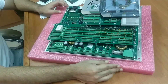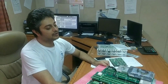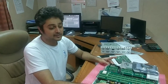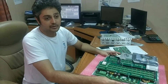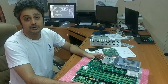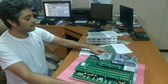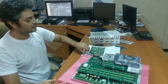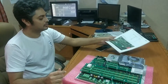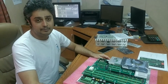Another thing is: when you go for classes about ME engines, they will tell you that all the components know what others are doing. This is because the MPCs are connected to the LAN — that is how we say the ME engine is online. It's like a common network on ships. These MPCs are all connected to LAN A and LAN B.